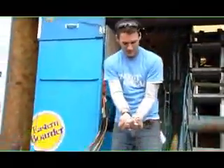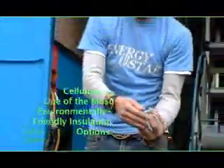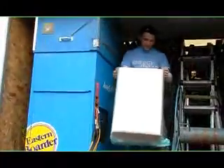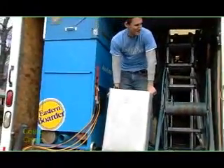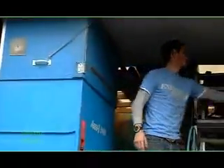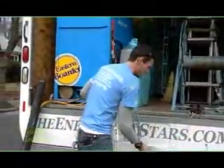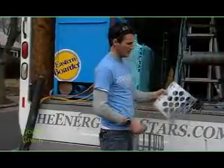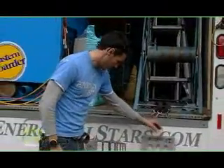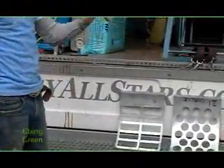Cellulose is out-of-print newspaper that's ground down and treated with a boric chemical. It's the most environmentally friendly insulation — second only to denim that I know of — but definitely more cost effective than denim. It comes in these average 25.5-pound bags. These go into our agitator, get broken up and mixed, and then shot down through different grates that we have for different applications. Right now we're using a smaller hose for the tube-fill wall application and a smaller grate applicable to that — this is for where there's no insulation in the walls. Then we have slopes and floors that we dense-pack, and then just an open attic.